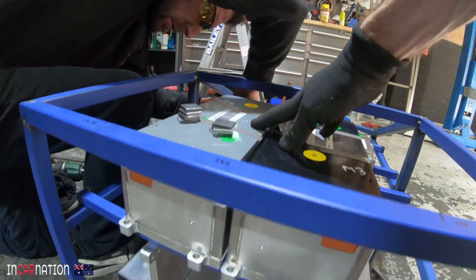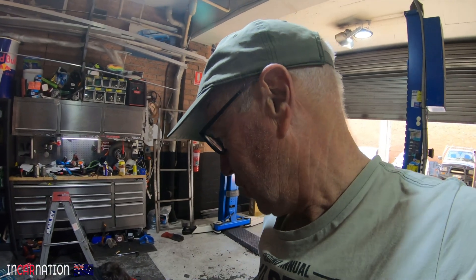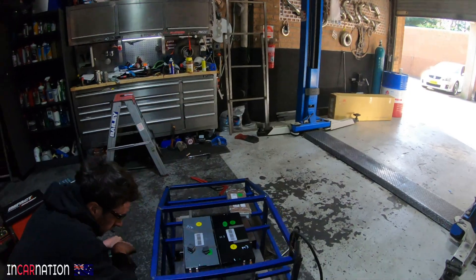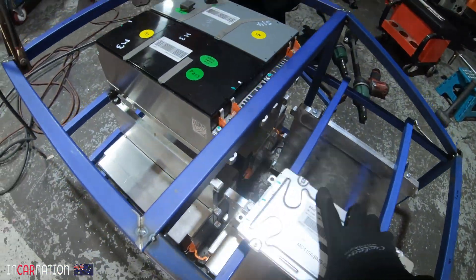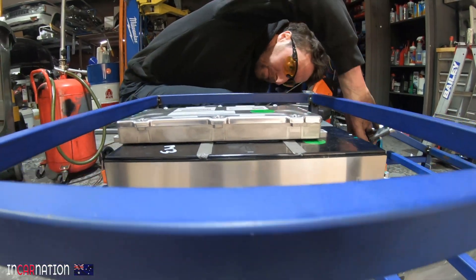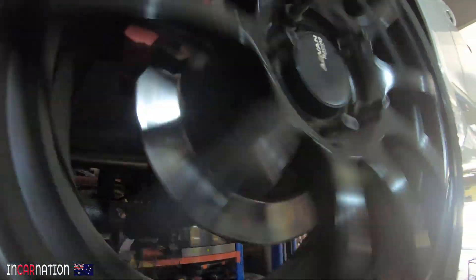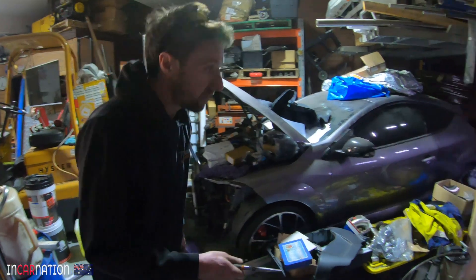That's how it is — just the two batteries on top. You'll notice they're slightly left of centre, and that's to compensate for my weight on the other side of the car. I could put them further over, but there's a reason they are where they are. And then 16 batteries below. It looks like the BMS might actually go here, but as you'll see later, it doesn't — I was actually lying in bed thinking about it and came up with a better way.